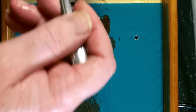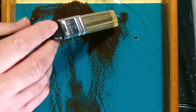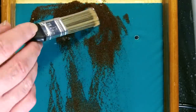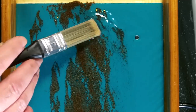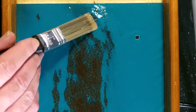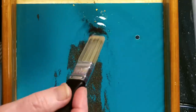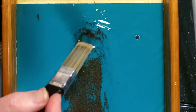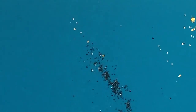It's kind of nice to see it's not all tiny stuff - I think I see a little bigger pieces showing through, which is good. As you can see, it is a little time-consuming, but with the smooth water flow you can see what you're doing very easily. If you have your table angle and the water flow adjusted properly, it's no problem to separate that very very tiny gold from the rest of the black sand. I think this will do a pretty nice job for you.